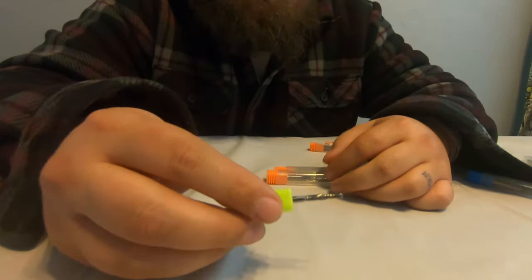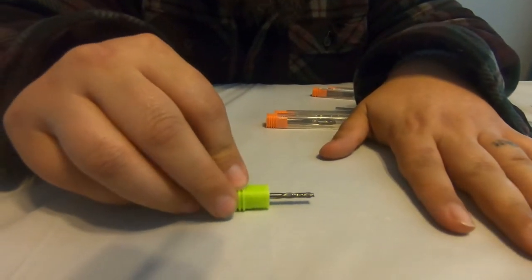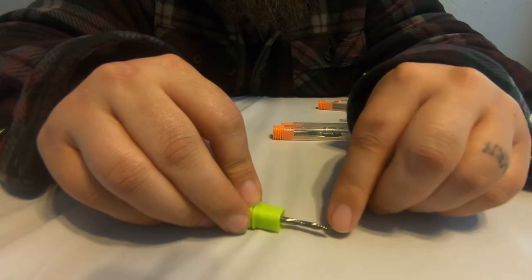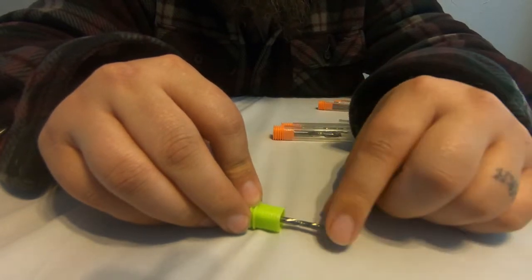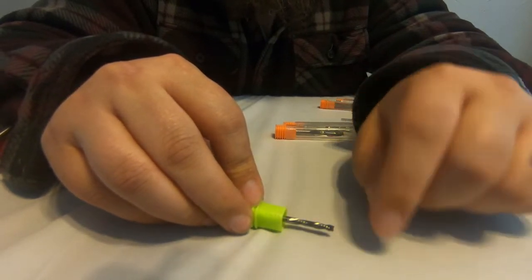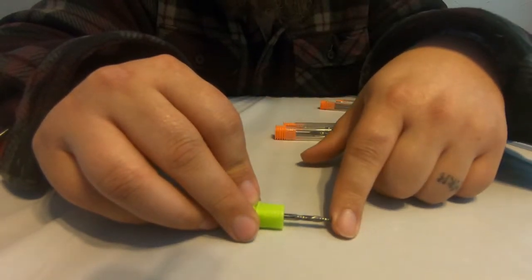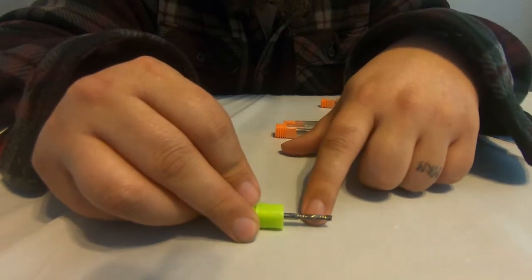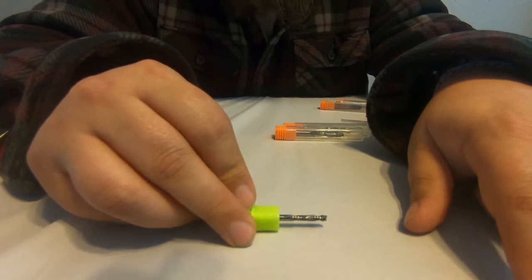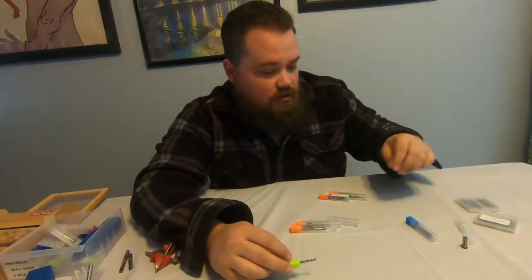This little bit is actually a combination of the two — it is an eighth inch two flute spiraled compression bit. The very tip is an up cut, so it shoots sawdust up and that's how you get a good first cut. Then the rest of it is a down cut, which leaves all your finishing super smooth. I use this on all of our letters — basically anything I do in MDF, this is the bit to use because it leaves the finish incredibly smooth and we have to do less finishing after pulling anything out of the CNC. You can get these in eighth inch or quarter inch.